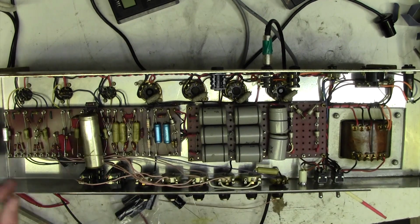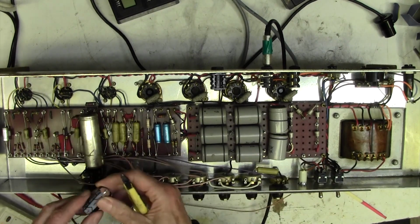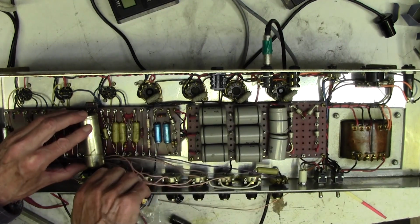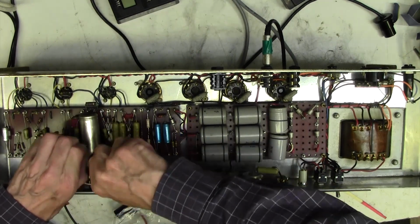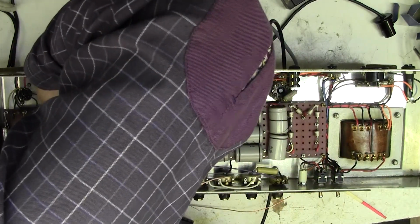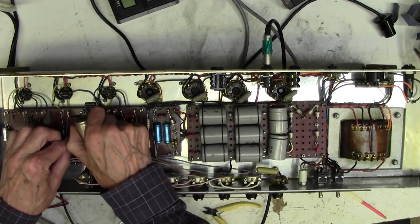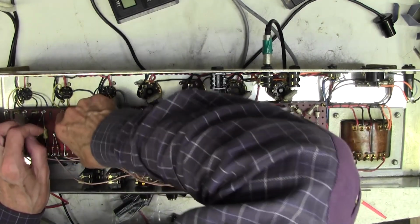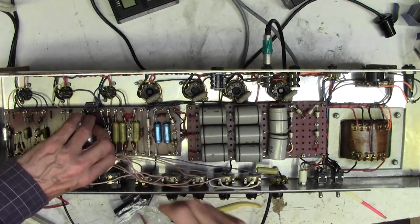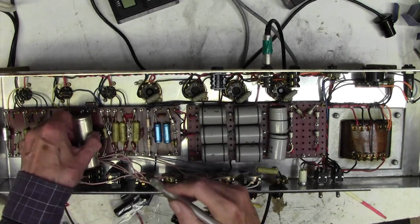Now it's a question really of whether we can get the caps to fit. I've got some, these are 32 microfarads at 450 volts. I've got some 47 at 450. They would obviously be better and give a little bit more smoothing. Let's just chop this hideous thing out. Glued in too with a huge wedge of cracky. Well, that's not even going to come out, that. I'm going to need to apply my surgical skills.